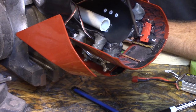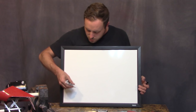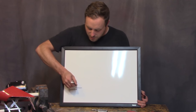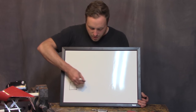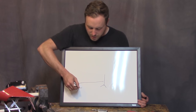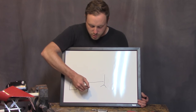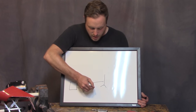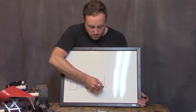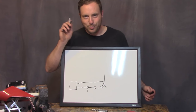Since I'm explaining this, I might as well talk about the electronics. Electronic system one: you've got a battery with positive and negative wires. One goes directly to the rocket to set it off. The other one goes to the limit switch first — the limit switch has to get pushed by the servo before it works. Then it goes to another switch, and when you push that switch, it goes to the rocket. The circuit is made and the rocket goes off. Super easy.